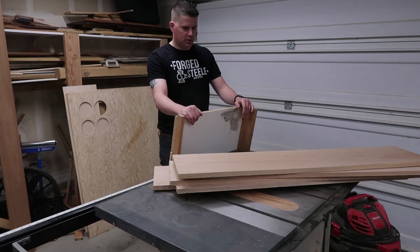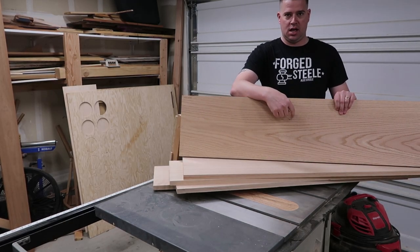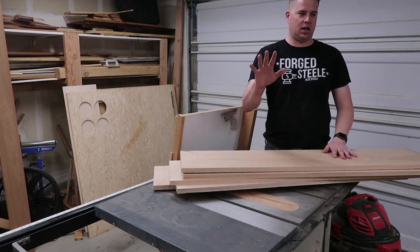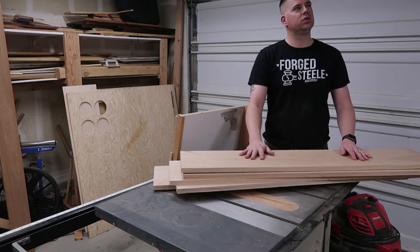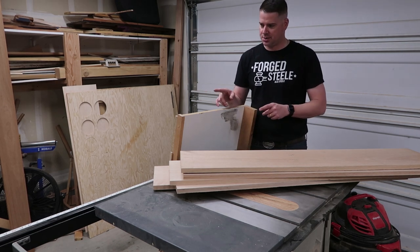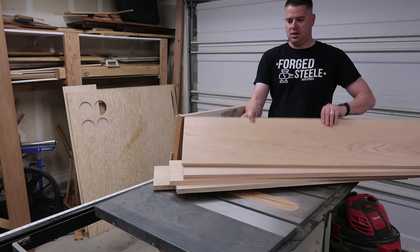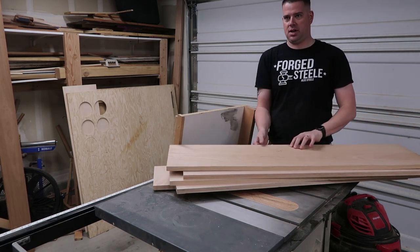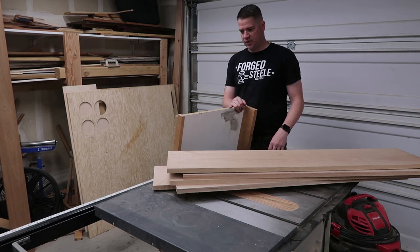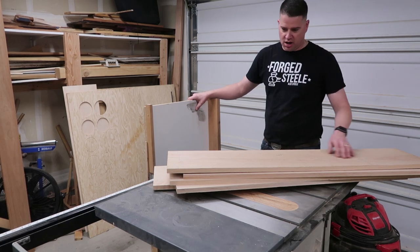I've got everything labeled and I also write how long each piece is supposed to be on the board so I can't screw it up — some are going to be 45 inches, one's 46, and I think the sides are 40 and a half. I'm going to use the table saw rather than the miter saw because I want more accurate cuts. This material is expensive at $37 a piece before my 10% military discount and tax, so I don't want to go back to Lowe's. I'm using the sled and squaring off one edge first.